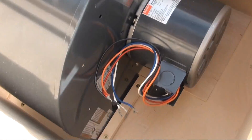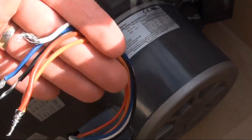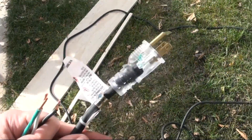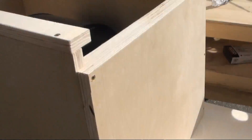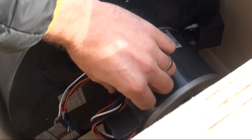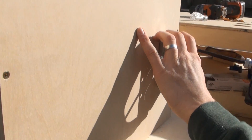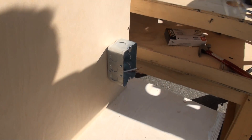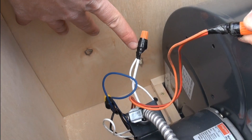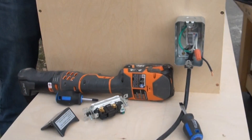Now it comes time to actually wire up the blower — and full disclosure, I'm not an electrician — but I'm following the wiring diagram on the side of the blower. We've got a heavy gauge extension cord with the end cut off to reveal the wires, and on the other side will be a plug we can plug into the wall. In between, we're going to put a switch and mount it onto the side of the box so we can easily turn the flow hood on and off. We wired it up the way it says on the blower: orange going to red, white going to white, and blue and black going to black. That wiring gets bunched up nicely into the junction box, nice and safe.